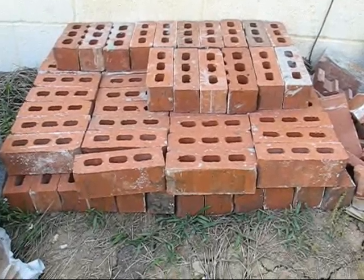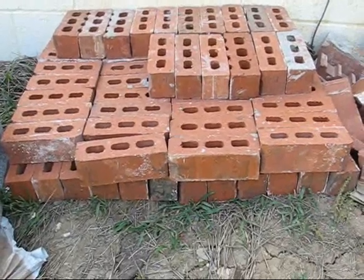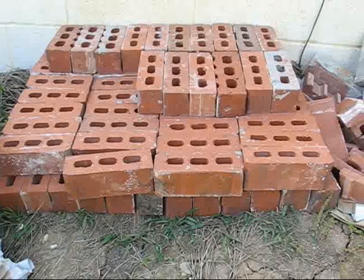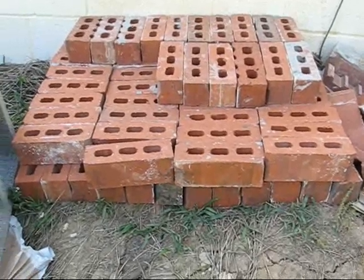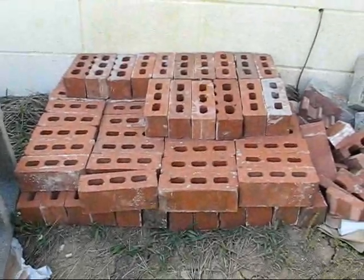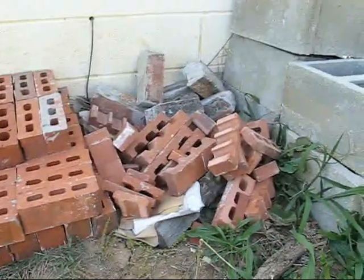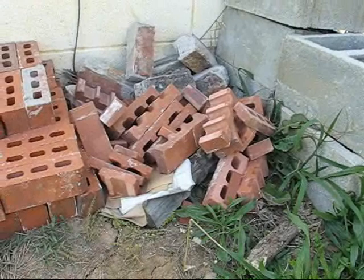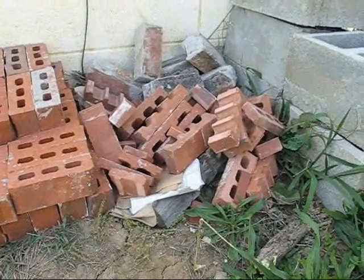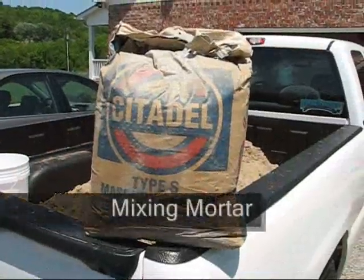That particular pattern — setting bricks directly on the ground — is the wrong thing to do because they'll suck up dirt, salts, and materials that will later leach out and give you a casting on your brick. Don't let them get wet and don't put them directly on the ground. It's bad practice. I'm doing it because I'm using them as fill — same reason I save that rubble there, to use in a ditch or a hole.